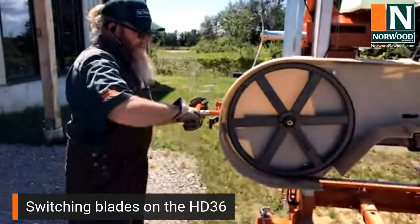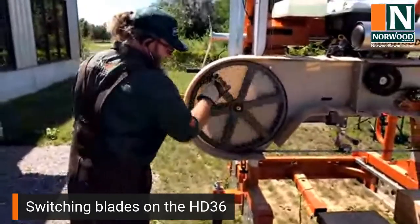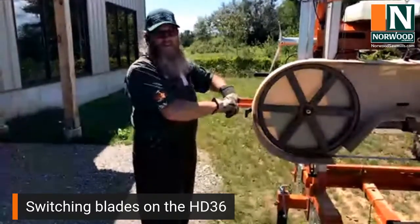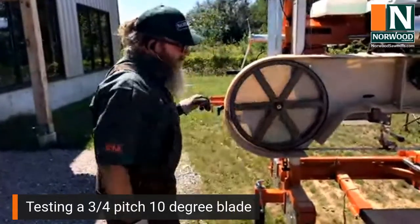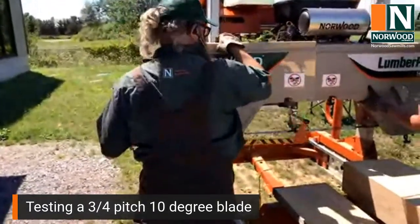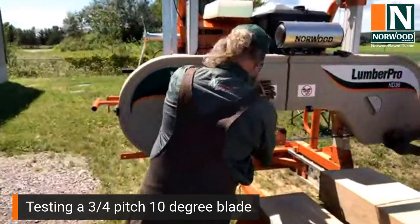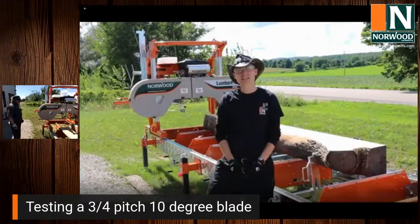I'm curious, same as everybody. See what that might be. Now I got this pretty tight, guys. Like normally I'll set up around six, but I know this is wicked hard, so I'm running about 6.5 turns. So I'm running full pressure on this blade. That's all happy. No noise, guides are set. Here, run through my little mental checklist, get all these latches done up. Okay, that's happy. So I think we're good.